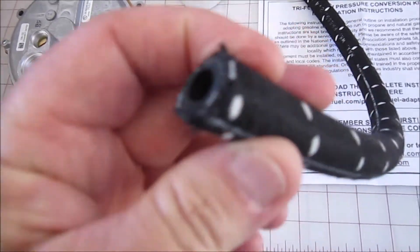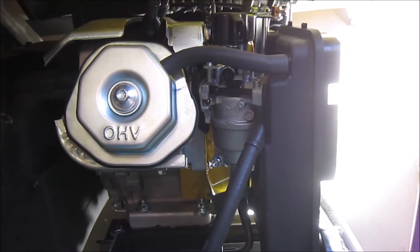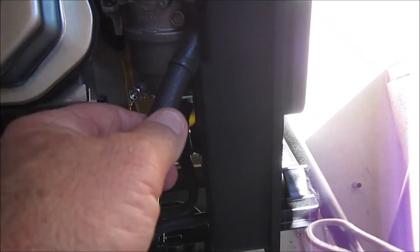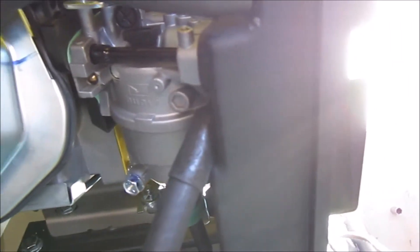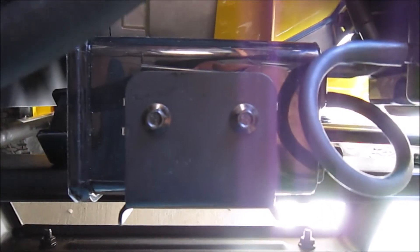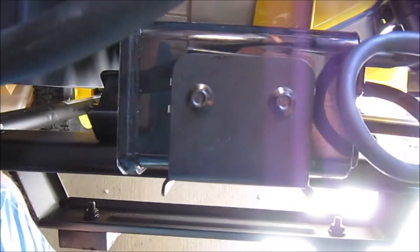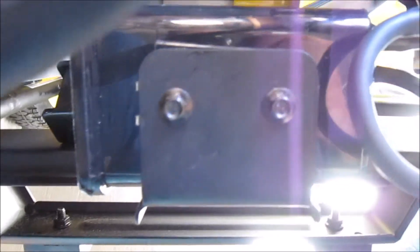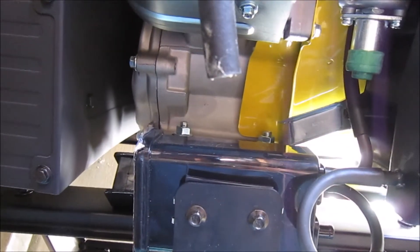The Motor Snorkel is mounted. It fit pretty good - there's a little interference on the plastic housing for the air filter so it's slightly cocked sideways, but it cinched down and it'll be a pretty good fit. I'm going to mount the regulator on this bracket - it appears to be some type of California Air Resources Board vapor tank bracket. The regulator has to be mounted in an upward direction with the outlet on top, so the hose can be put right into the top of it.